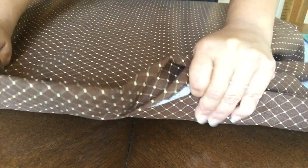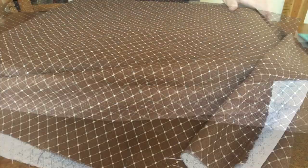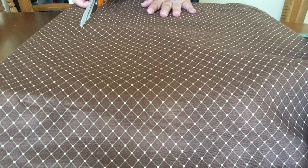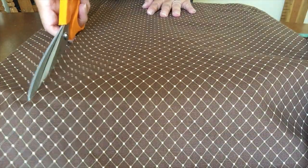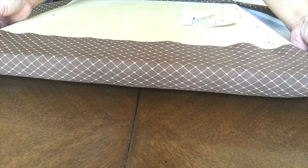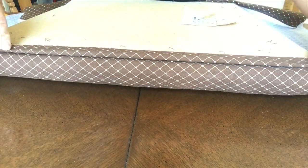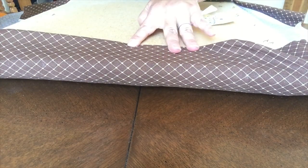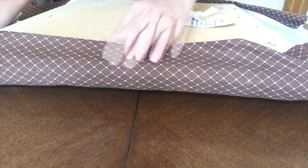On the opposite side, I'm just going to pull the fabric because I want it to get that fitted shape of the cushion. Try not to pull it too tight. I'm going to turn this around, straighten it up, and trim the fabric. Then we're back to pulling the fabric towards me — staple at the center and repeat this on all sides.